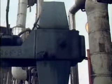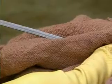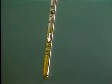In this large gearbox, for example, the oil level is checked with a dipstick. With the unit off, the dipstick is wiped off, then pushed all the way back down into the oil and pulled out again. The level is above the low mark, so it's in the acceptable range. If it were at or below the low mark, more oil should be added.